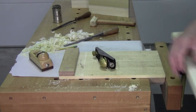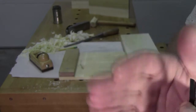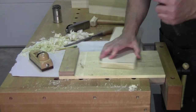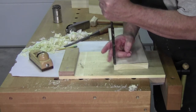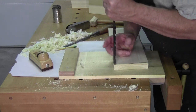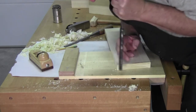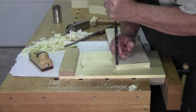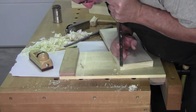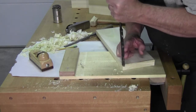You want to get really fancy? You want to take those corners off? Do you have one of these? A gouge? Real quick way of taking the corners off is with a gouge, and you turn the inside towards it, lining the points up on either side. Okay, and you can keep coming in until you are at the radius of the gouge.